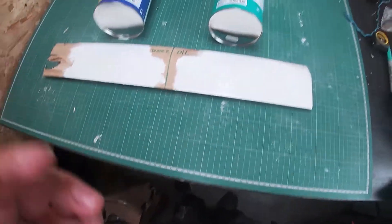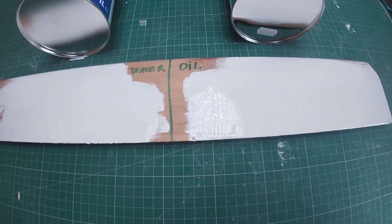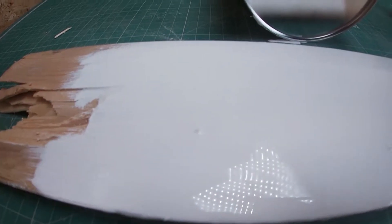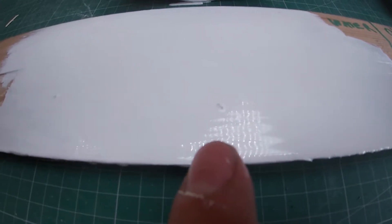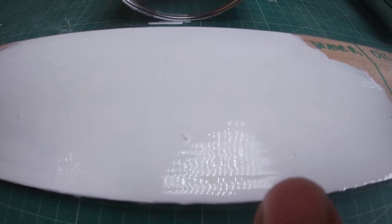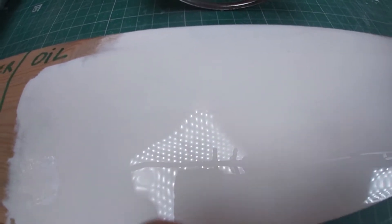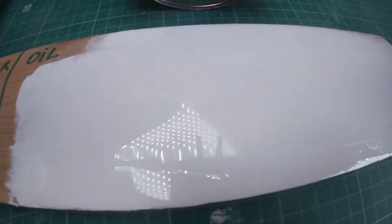Okay, let's have a look. With the second coat on the water-based, we can still kind of see through it — you can see the light and those brush stroke lines on the light right here. That's not good. Moving to the oil second coat — check the light, no lines. It's basically evened itself out and you can't see the wood through it anymore. It's a nice, proper layer.